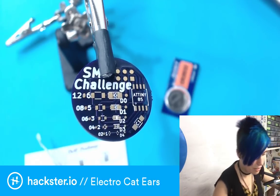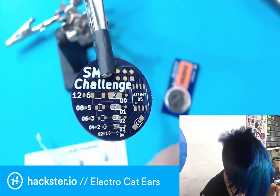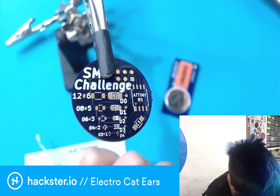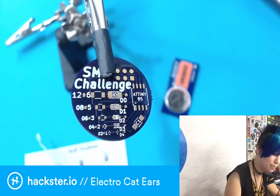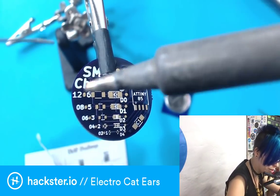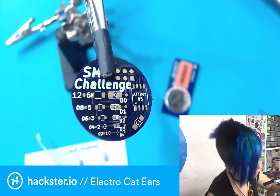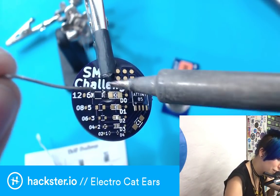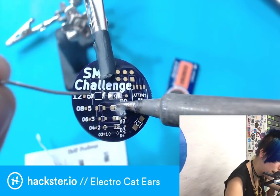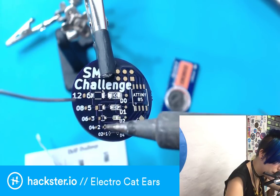You see that little arrow there? That means that's the way the diode has to go. On the actual LED itself, that may be depicted by a little green stripe, or dot, or something. I'm gonna tin this first. I wish I had some flux — I would just glob it all over there. I don't think this thing actually wants to have anything else tinned in the little zeros; I think they're just decorative. Okay, here we go. Some big tufts of solder here — that is not what I want. I want them to be relatively flat so I can put the component down.